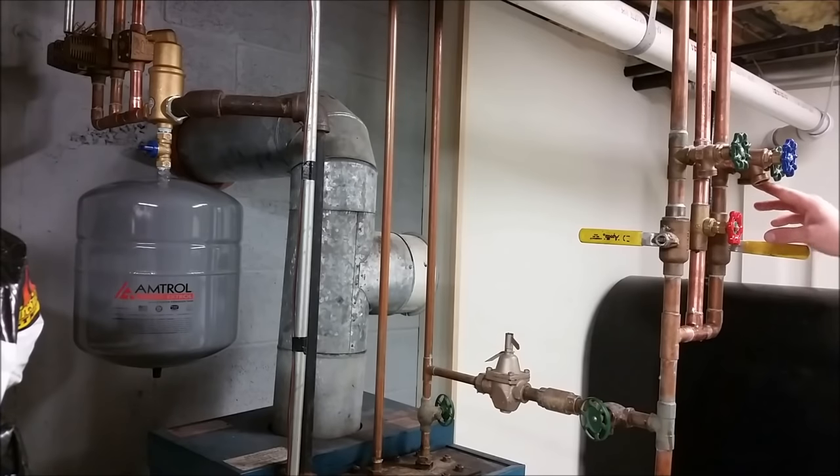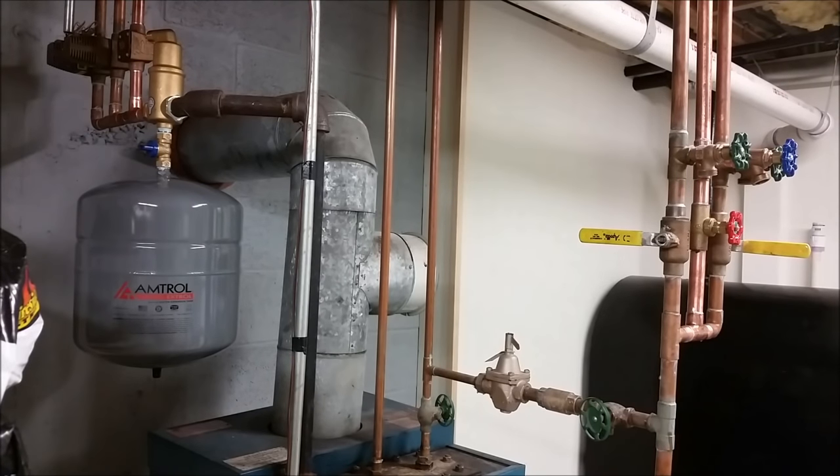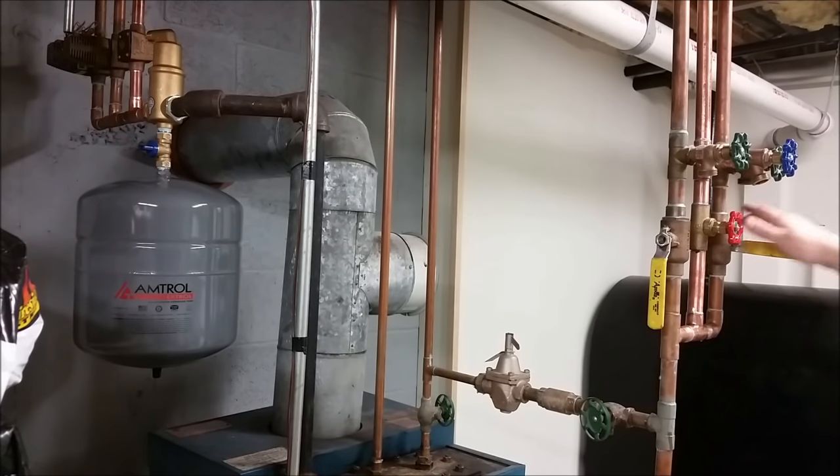When you detach your hose you might want a bucket handy — gravity is going to bring you some water. Or you can kink the hose over like I did and walk out the bulkhead and set it outside. Now that we've got our hose detached, we can go ahead and turn on our valves so the water will flow through our whole system making a perfect loop. Once we have the valves open we can go ahead and turn on our furnace. And that's it — we just showed you how to get the air out of your heating system or loops, so you get rid of the noise of the gurgling or banging from air in your lines.